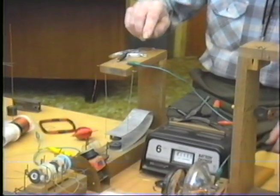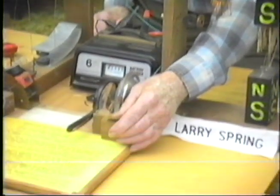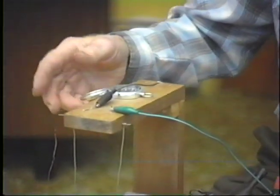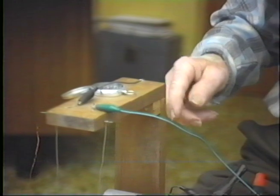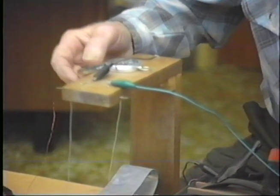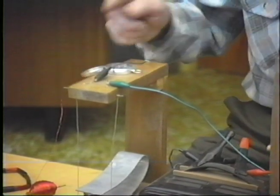This compass will show what happens as soon as I push the switch. When I push the switch — it's a little 12-volt bare switch, that's the only reason I can touch it; if it were 110 I wouldn't attempt to touch it — the compass will swing toward the ocean, which is to the west or to my right. If I pick this up and put it over the top of the wire, it will swing the opposite way. So this shows the current is coming up over here, down through this loop, and back around — that's the circuit. When I push it now, the compass immediately turns to the west, and when I pick it up, the compass turns to the east, showing there is a circular field in this direction around that wire.